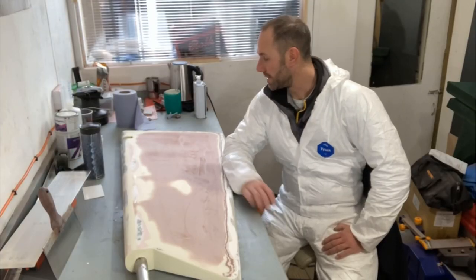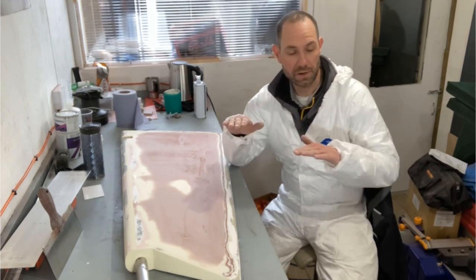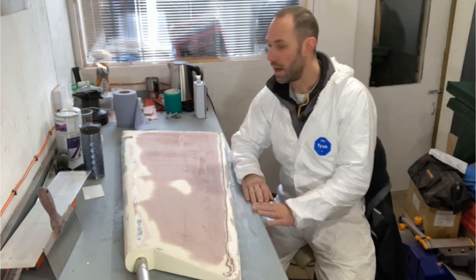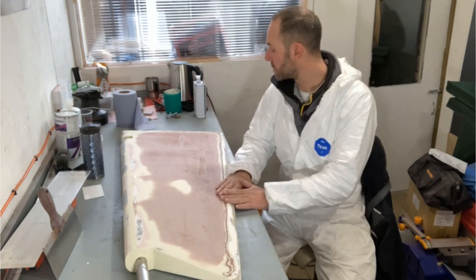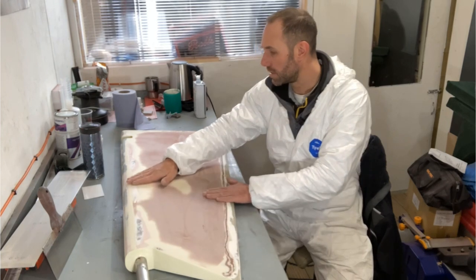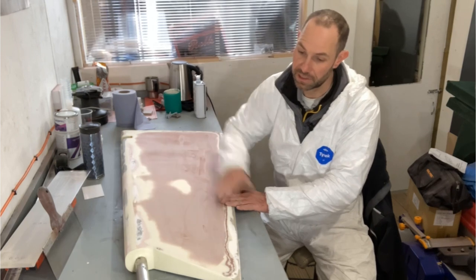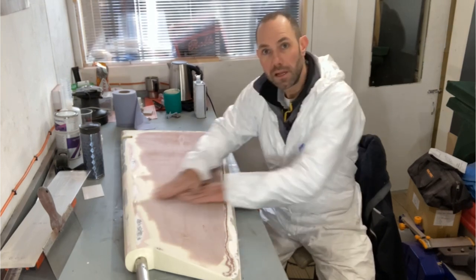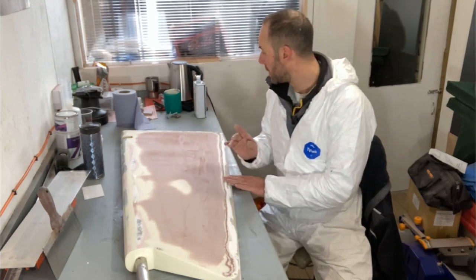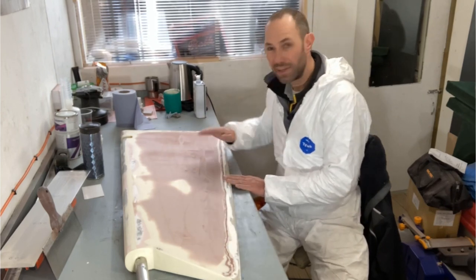That's the rudder blade sanded. I was using my longboard, which I can set to be completely straight. It has a little aluminium angle that you can lock into place along the blade, so that stops it from flexing and keeps it pretty much straight. That allowed me to use the reference surfaces. I think I used that term in the last segment. The reference surfaces being the front edge and the back edge, or the leading edge and the trailing edge. Then I can run the longboard over that and knock down any high spots. Afterwards I came back in with hand sanding and scratched up any areas that it didn't touch.